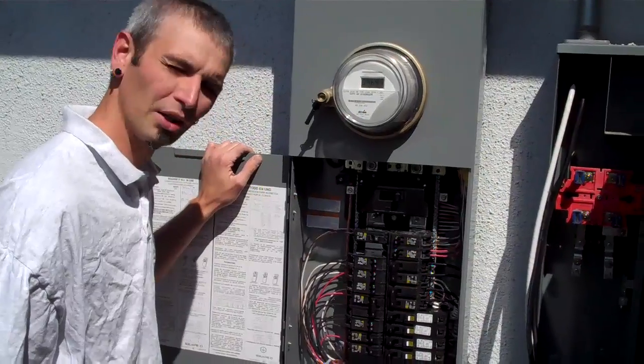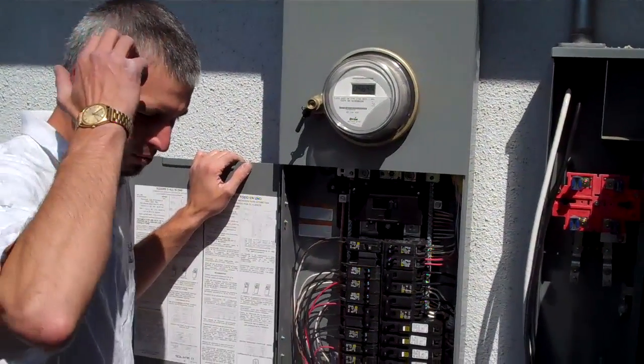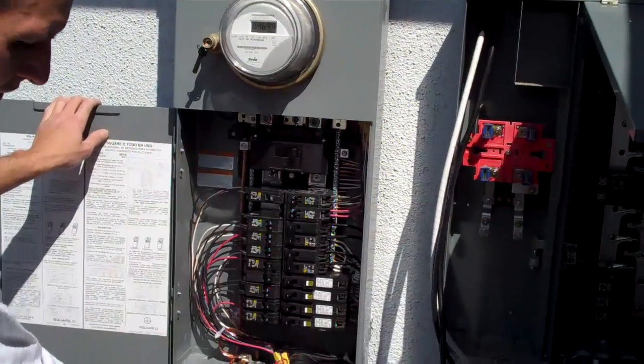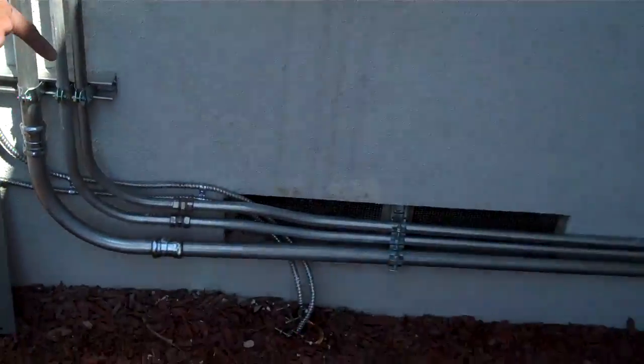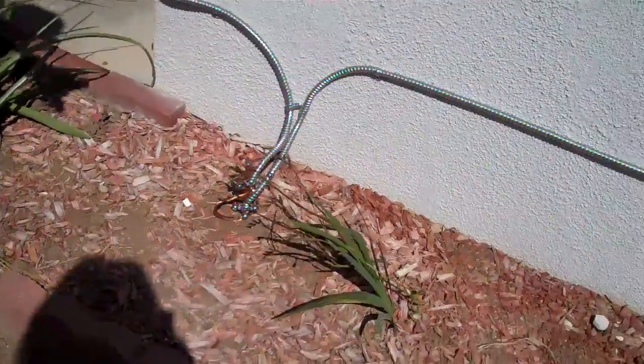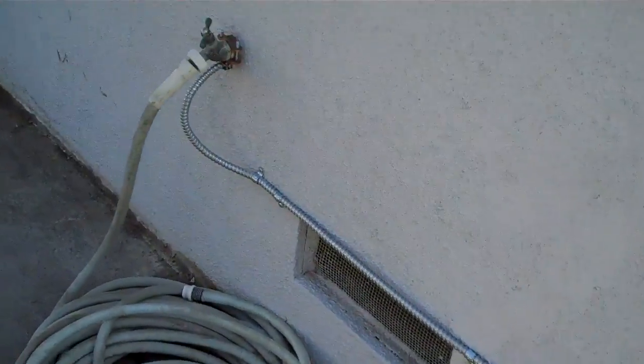It's done a little bit above code for this city, but we keep it standard. Basically how it works is the bond hits an electrode driven eight feet into the ground, and then six feet from that — or further in this case, because we needed to avoid damaging any of the water lines — another ground rod was driven. We're tapped into the water main, and then if you come around this side of the house, over here.